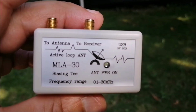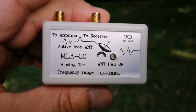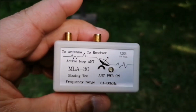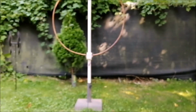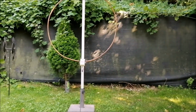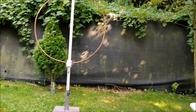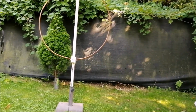Okay, the one from the SDR by ST, I wouldn't recommend that anymore, because this worked. Okay, so there was no need for that. That might work on shortwave, and even some medium wave. It's not going to work on long wave, because you're going to need that amplifier to bring you over the hump to get that signal. Otherwise, it's going to be buried.